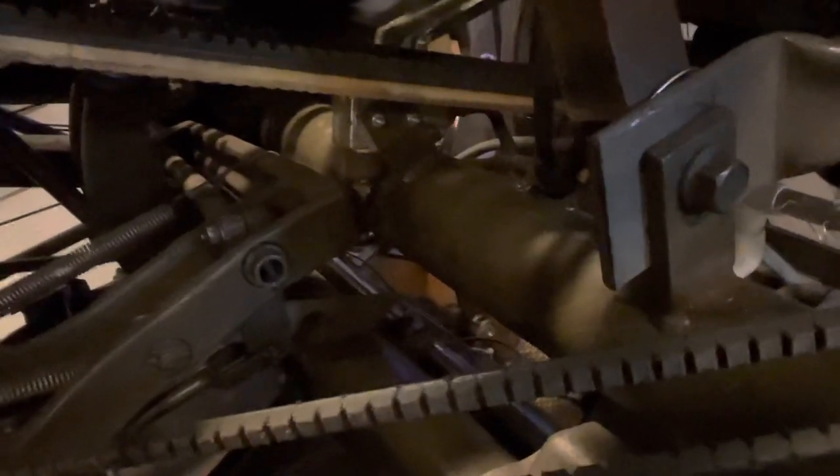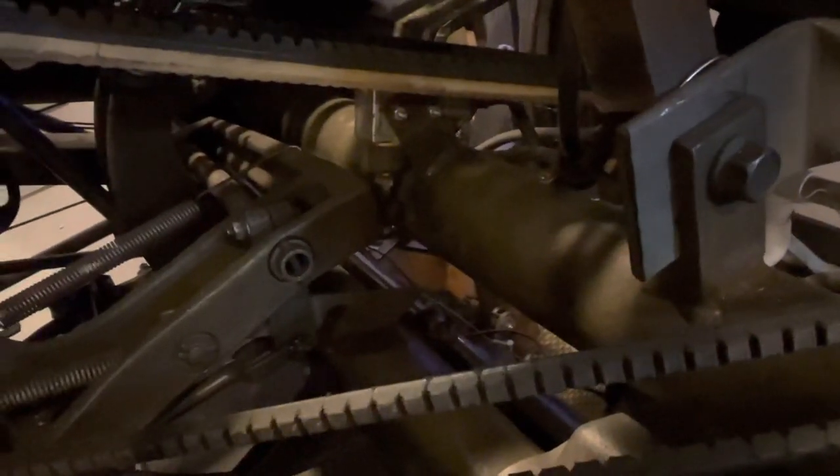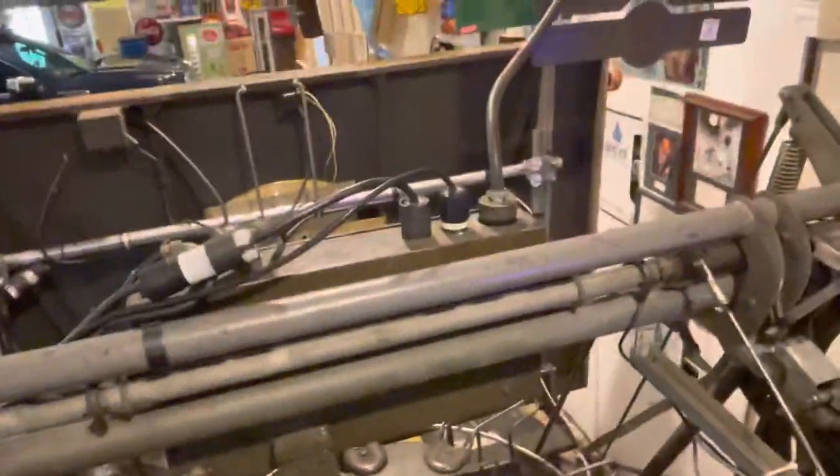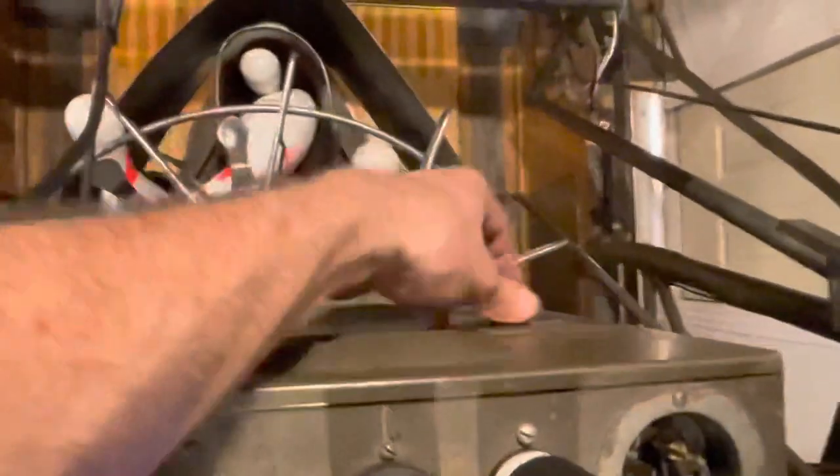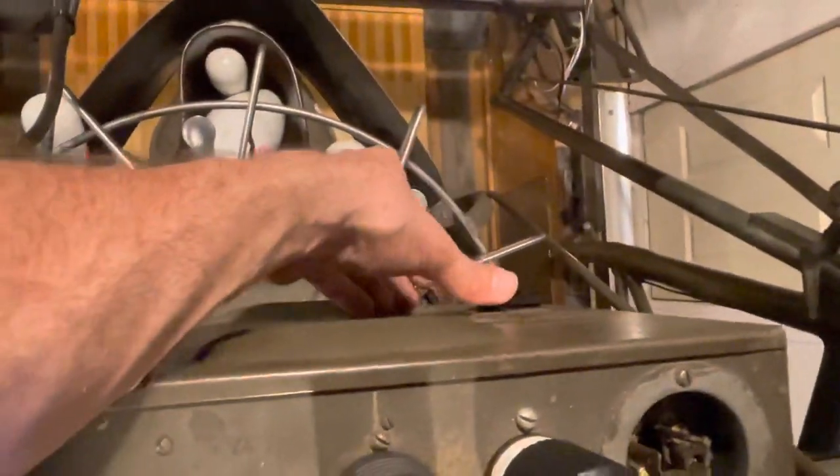You'll find the turret jam blackout switch underneath the cross conveyor, directly below the micro switch for the pin gate. First thing you want to do before you ever touch a pin setter in a situation like this — pull the plug. Always. And just to be sure, turn the breaker off. Make sure that breaker's off.